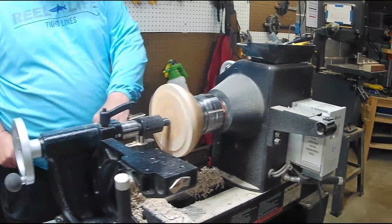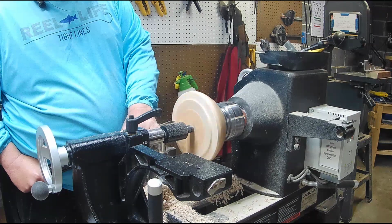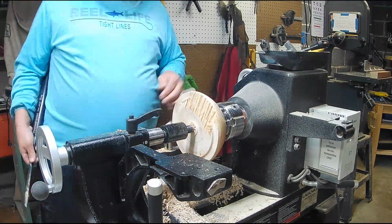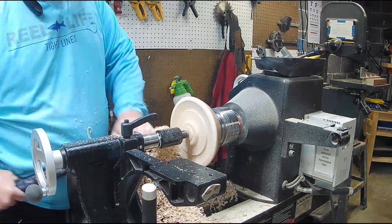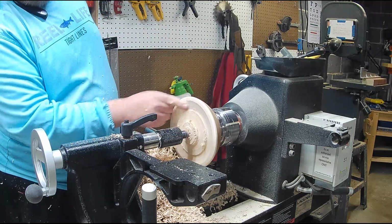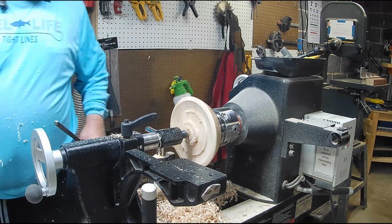Adjust the camera just a little bit here. Pretty soon, he'll be taking that tailstock away. He won't be in the way. Well, this next part is about just hogging off wood and getting down to where he can remove the tailstock and start hollowing things out. So I've speeded things up. Alrighty. Now we got it pretty much round. Got our edge established now where we don't go back to it. I know from past experience, you go back to it, bad things happen sometimes.